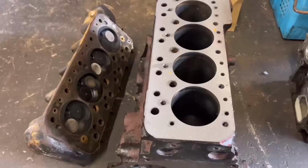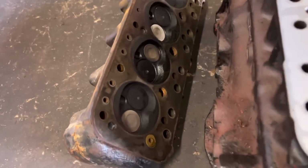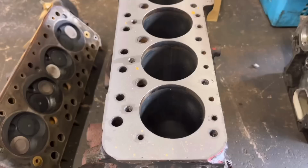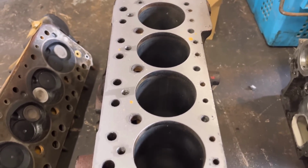Yet again, we've got another all been done job come in. Now this is an A series mini engine, and it hasn't come in for a rebuild from us, but it's coming for the machining. So the story is with this, that as you can see, it's already been refaced. We've faced that. But if you look at the cylinder head there, looking distinctly second hand, this thing is a 1320. So obviously it's been bored right out.